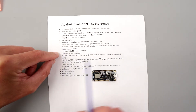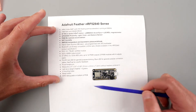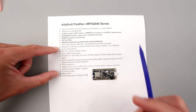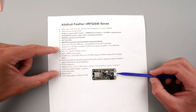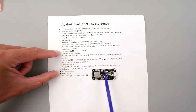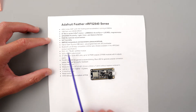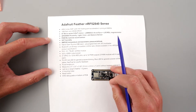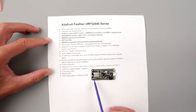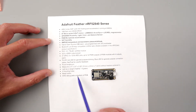In addition to Bluetooth Low Energy, it uses the very well-known nRF52840 chip from Nordic. Adafruit has done a great job porting all this to Arduino and it works very well. This board has an open-source USB stack, so the bootloader is already there - when you connect it to Windows, Linux, or Mac it will be recognized natively. The native USB stack in this chip is hardware-based, no fancy workarounds needed. The module is certified, has 8 dBm output power, and an on-board antenna with a U.FL connector if you want to attach an external antenna.